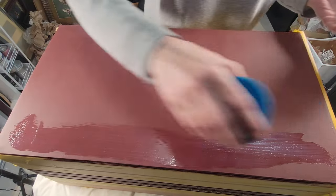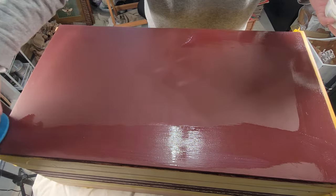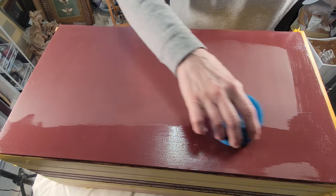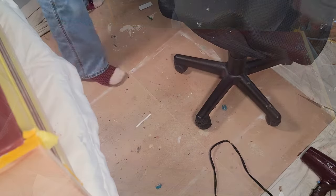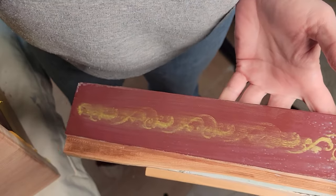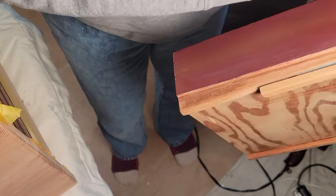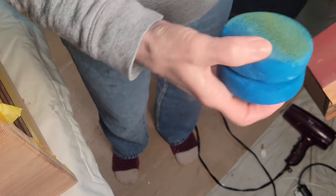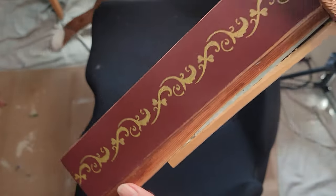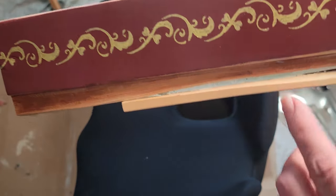My back is ready so I want to get my polycrylic on there before I move on for protection, because I just like to get the things protected before I move on with other portions of the project. So there were three coats put on. Now here is the drawer — I wanted something special. Look at who smeared their paint with their polycrylic — gotta wipe it off. This time around after I stenciled it and it was dry, I sprayed it with some polycrylic before I wiped polycrylic on. So here is my drawer — it's looking good. I like the stencil on the side. The rail is working great, no problems with it.